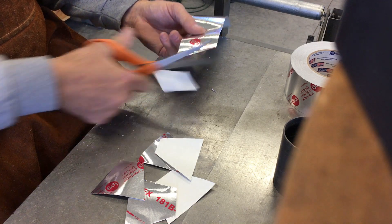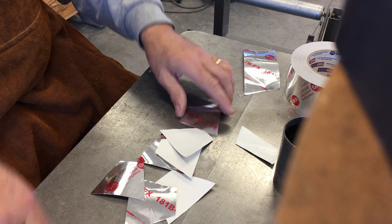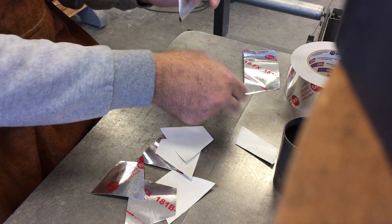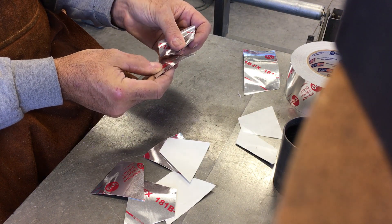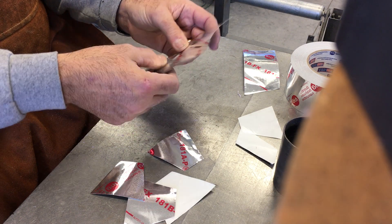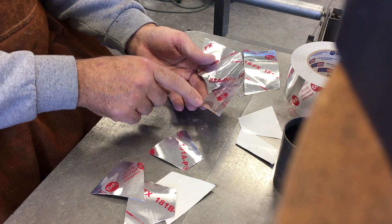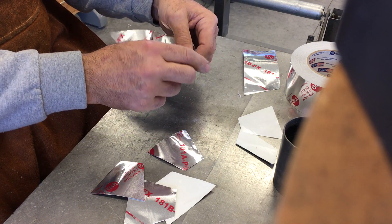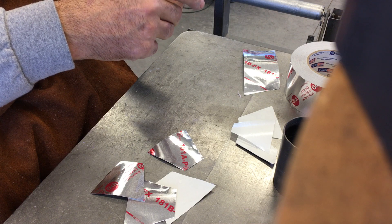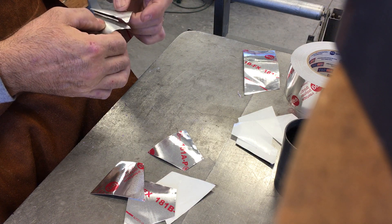There's a bad spot there — get rid of that. Then I just take one of them here and peel it back, stick it on a couple there. Depends on what size sprue you're trying to attach it to, but I usually use about a one-inch round nub, so three inches or so down there is what you're shooting for. Then I peel these off like so and stick it together.